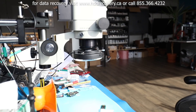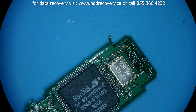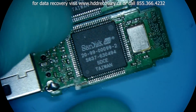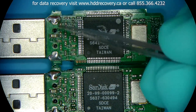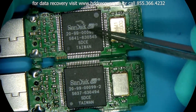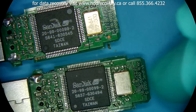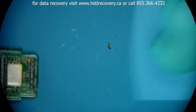Just for confirmation, let me quickly put it back on and plug it in now. No signs of life. This is the NAND. This is the controller. We're going to look at the part number of the board: 5450-00440 revision 2. The two donors I got look very, very similar in design. Where it differs is this area — the layout is slightly different, the components are arranged slightly different. Both have the 99-2 controller on them, but the board numbers are different: 5450-443 revision 2 and 5450-440 revision 2. Our board is 440, so we're going to use 440.